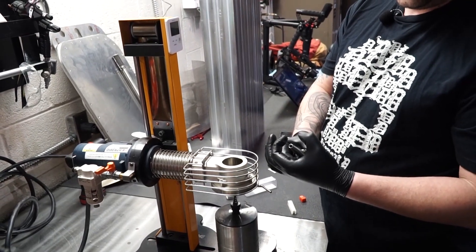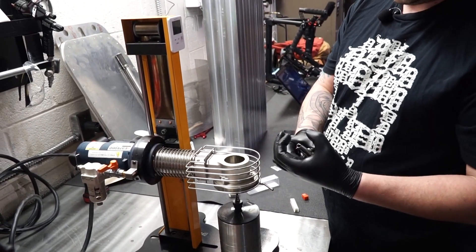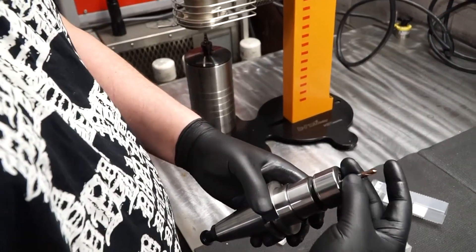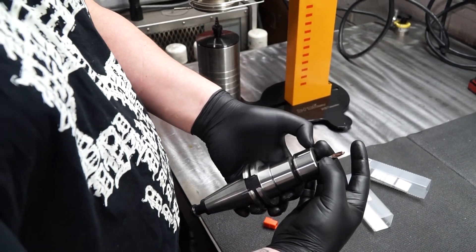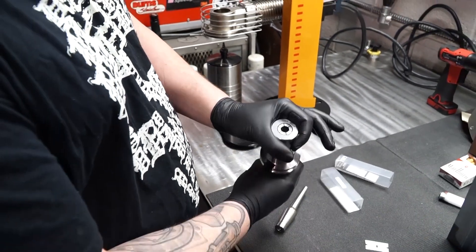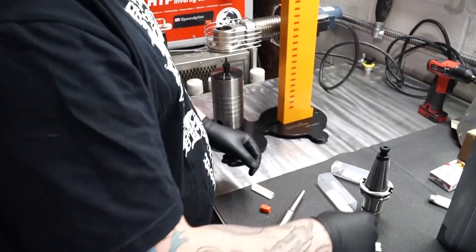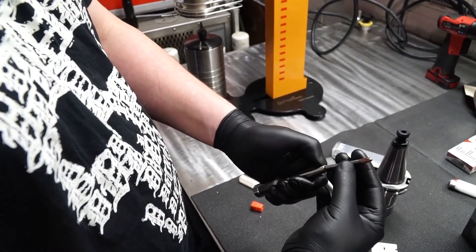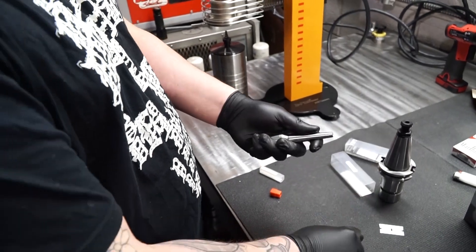The diameter of the holder is very close to the tool I'm gonna use — it's not a big head like a collet holder. Here's a collet holder versus this tool: as you can see, I'm limited by the clearance of the holder itself, whereas with the heat shrink, that is the clearance I need to worry about — just a couple millimeters over my tool.